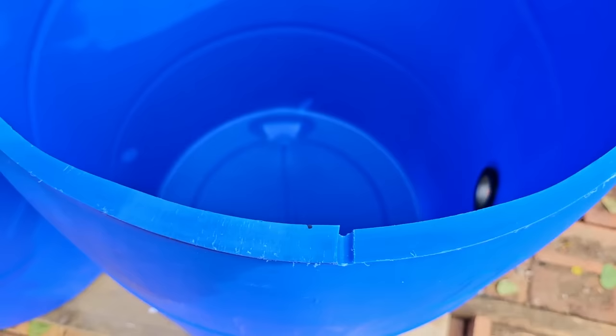I did have a couple of leaks actually. This fitting here isn't the original one I put in - I was in a bit of a rush this morning and I stuffed up the glue job, so I substituted some other components. There were too many holes and it sprung a leak. I went back to the original fitting - luckily these valves you can pull apart, so I took off the bit I didn't want, put on the bit that I did, came down here, zapped out the old fitting and popped in the new one. She is working absolutely fine now, no leaks whatsoever.